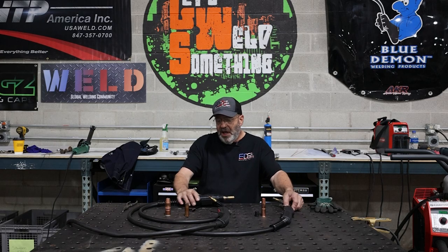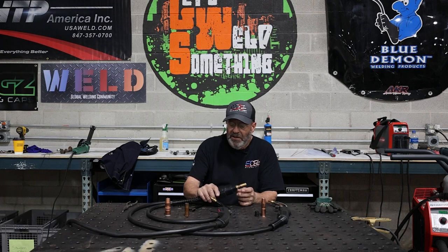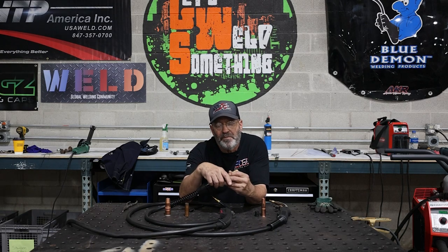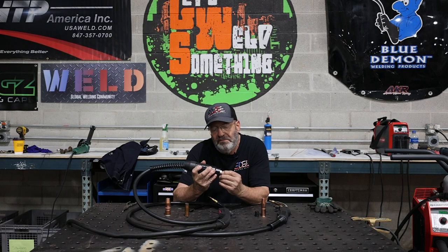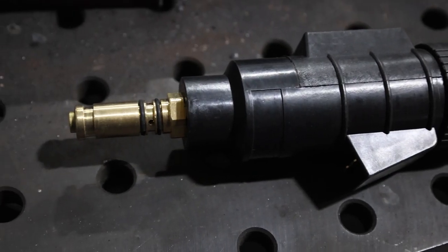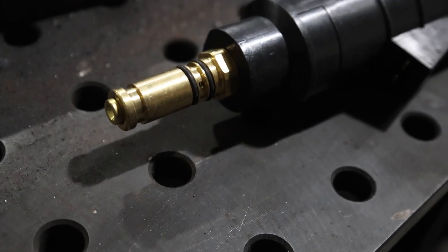It doesn't matter what the gun, you're gonna have some common parts that share purpose. Your back end, doesn't matter if it's Tweco, Bernard, Miller, Lincoln, it doesn't matter. You're gonna have some O-rings back here, okay? And you need to take care of these O-rings.